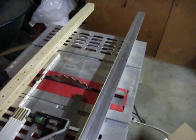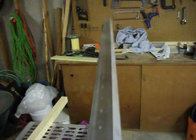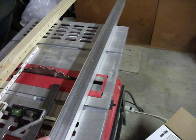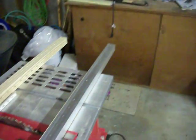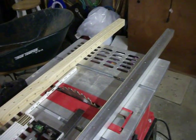I went to the Makerspace in Dallas and brought the problem to them — we were trying to come up with some kind of mechanical solution. What they came up with, and it's turned out to be really cool, was a template. This is a piece of right-angle aluminum. I measured it once, perfectly, and cut little template holes in it. Now whenever I want to measure something rapidly, I just lay it down, stick a pencil through the hole, and make a mark. The holes in the template aren't perfectly lined up, so I still need the stop on the back of the drill press to center the holes in the wood, but it does measure the length correctly — saving a ridiculous amount of time.